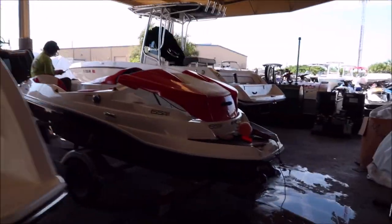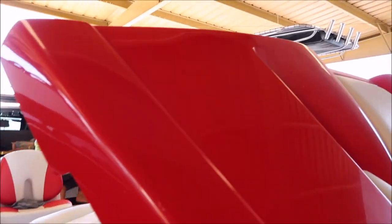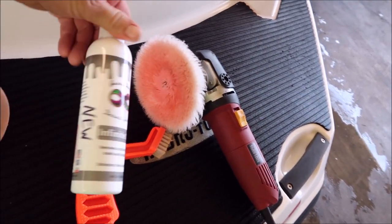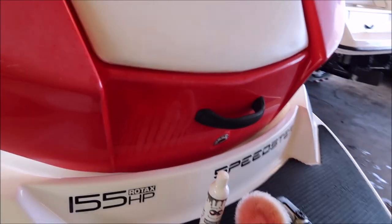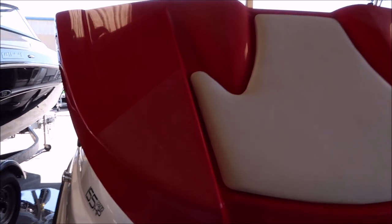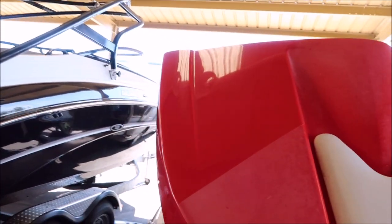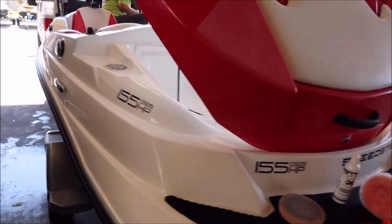I could hit this with 2500-grit or 2000-grit sandpaper, then compounding and polishing, and it looks great. But fortunately I was able to get it looking that good with just the Buff and Shine wool pad on the Harbor Freight DA and the brand new Infinite Cut — which is my auto polish. On newer gel coats that are colored, the newer nicer stuff is a lot like painting — either single-stage paint or even clear coat — over the old thick gel coat that's real hard to correct. On newer gel coats, since 2000 and newer, the auto polishes work great.